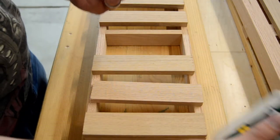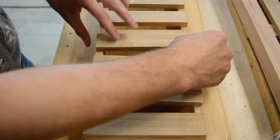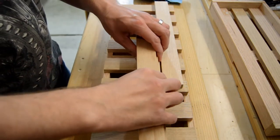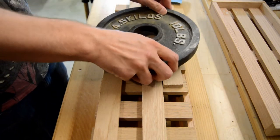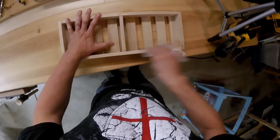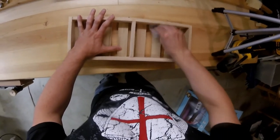When drying wood glue like this, I like to place a scrap piece of wood over the piece and place the weight on top of that. This will provide an even pressure, much like when clamping, and prevent the weight from damaging the piece. Once the glue has dried, this would be an appropriate time to take a flexible piece of high grit sandpaper and smooth everything out.